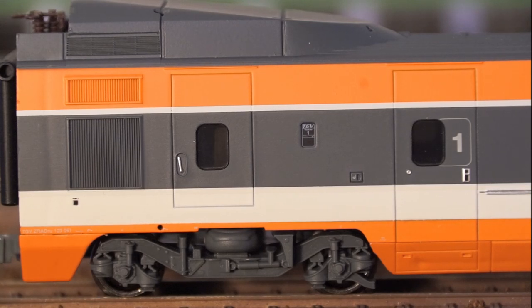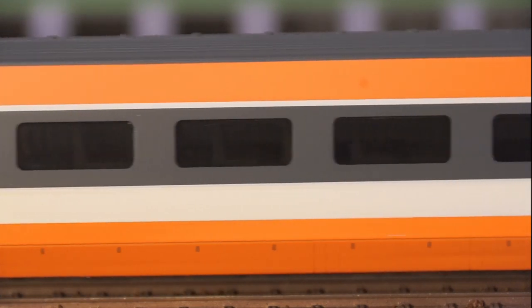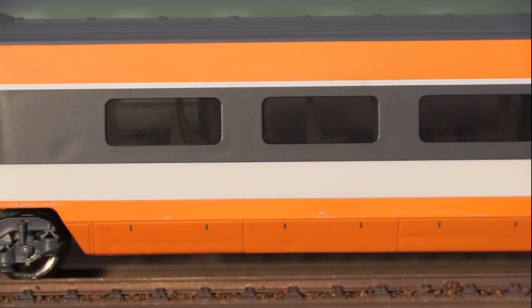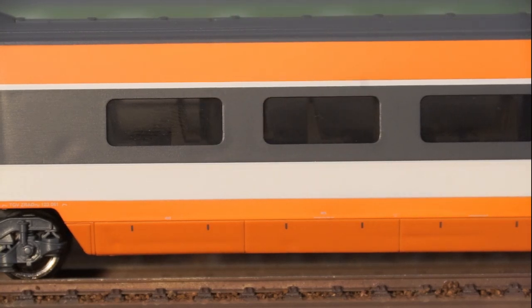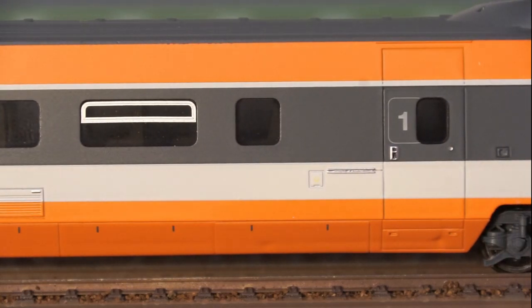This is exactly the same spot but the second transition car, and in this case everything seems to be okay. The same transition car, that's the second transition car, the opposite side. It's hard to see with a high contrast image from a camera, but there's a hazing going on at the bottom of this line. There's some overspray, and without the direct light, with the naked eye, I can clearly see that there's some overspraying. And here are some additional details, which are actually quite nice.